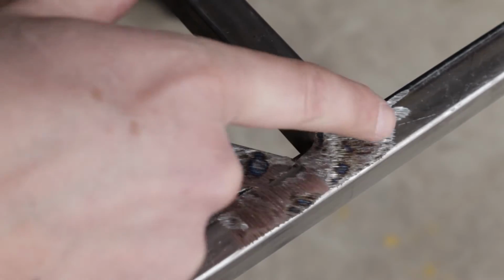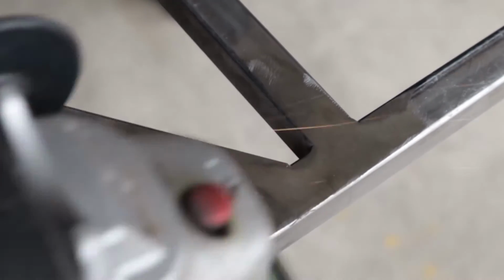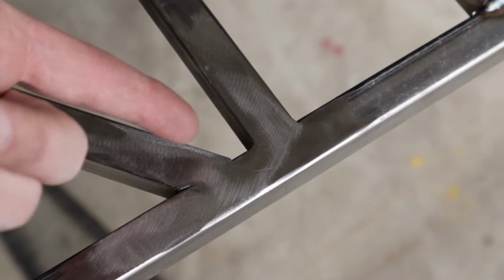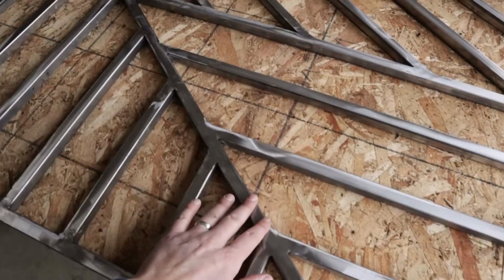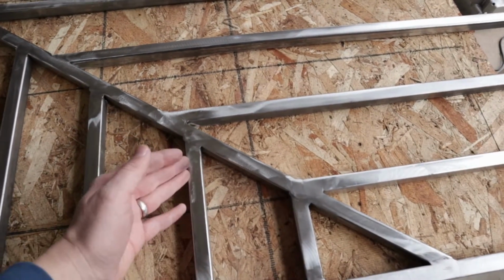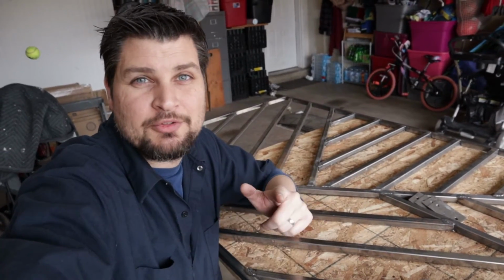As you can see, the grinder leaves all those scars in it. Well, let's clean it up with the flapper disc. Check out that hot sauce. I'm not gonna lie to you, I actually prefer a nice bead weld shown versus a ground down one. So I did both on this project. One side I completely ground down, flattened every weld, and the other side I'm keeping them all. Just gonna hit it with the wire wheel and make them all look pretty and ready for paint.